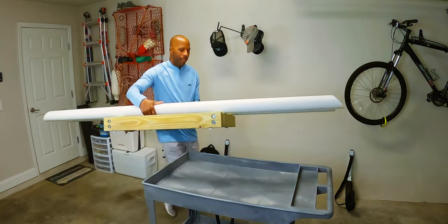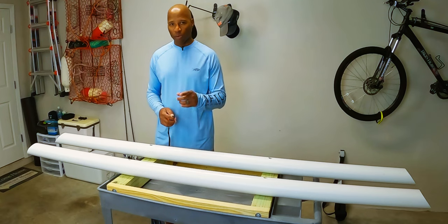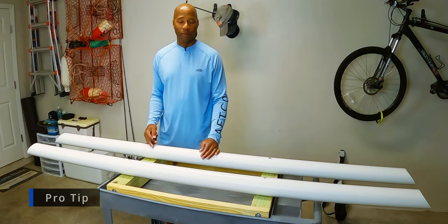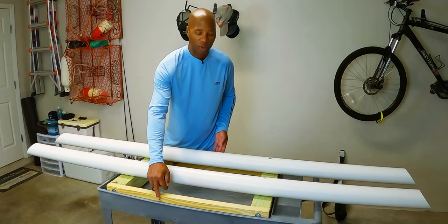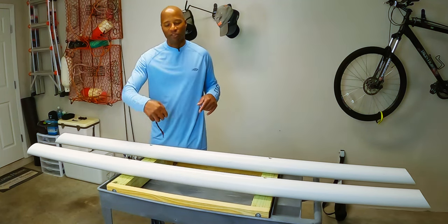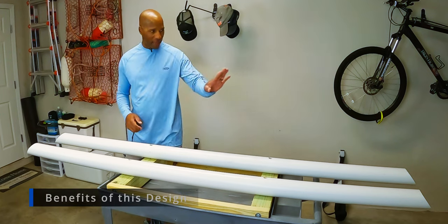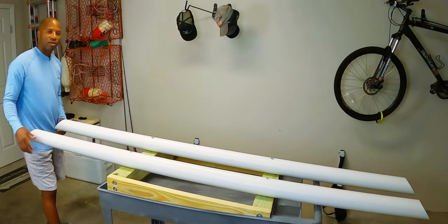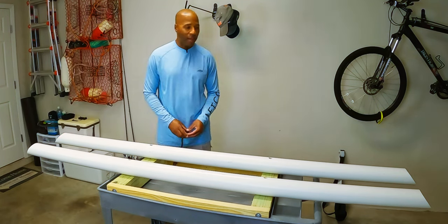When you're building out this cart, it's really important to get the 4x4s the exact same length, and they need to have squared off edges. I got these 4x4s from Lowe's — don't trust the edge of the wood from any store like Lowe's, Home Depot, or any lumber yard. Go ahead and take your saw and make sure that it's square. The box you're building needs to fit exactly in here, especially the width measurement. I made the length a little short because as you load your kayak in and push it into the truck, the kayak will bend down and the edge here will come up out of the cart — that's perfectly fine, it assists you in getting the kayak to slope into the truck.